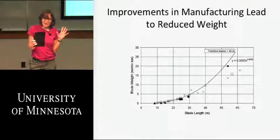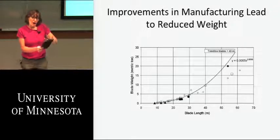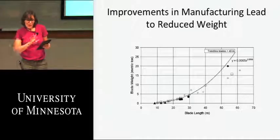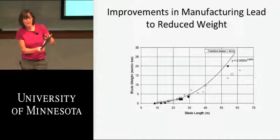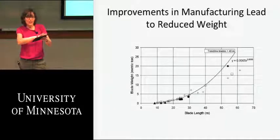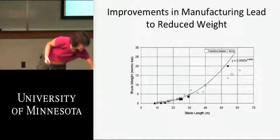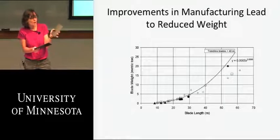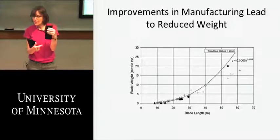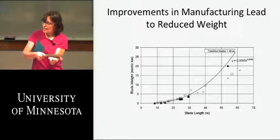When you look at it, one of the things I want you to notice is the amazing surface finish on it. It's really smooth. We just made it in our lab, but basically, with a composite, remember you always have that resin flowing. So whatever surface the resin touches, it's going to take on that shape. So here we had a very highly polished mold. When the resin, which is liquid, is just touching that mold surface, it's going to come out just as polished as the mold. Now I'll pass out another one. On this one, one side is kind of bumpy and the other side is really smooth. That's because when we made this part, the smooth side was down on a very highly polished mold.